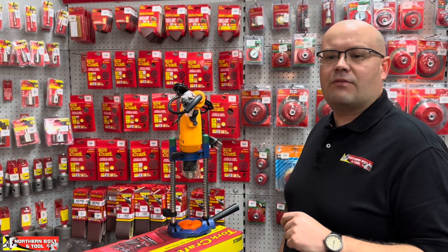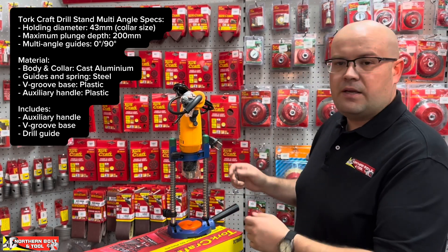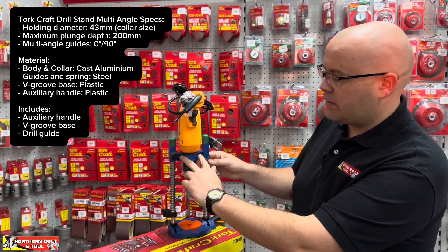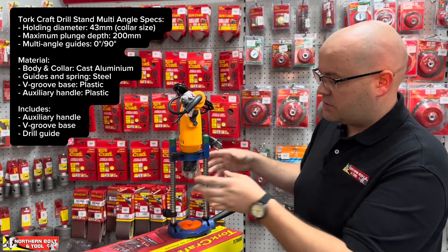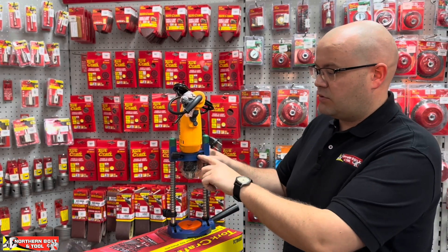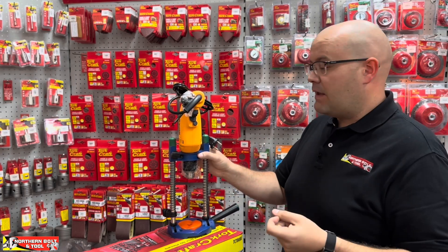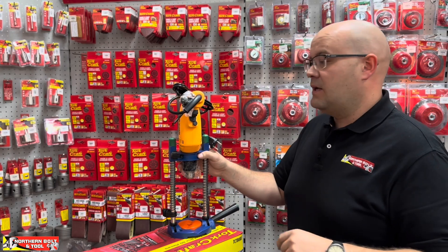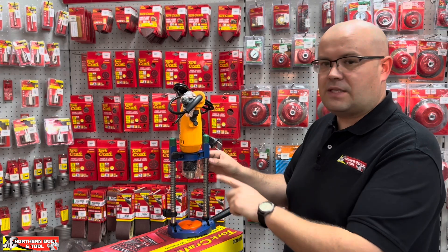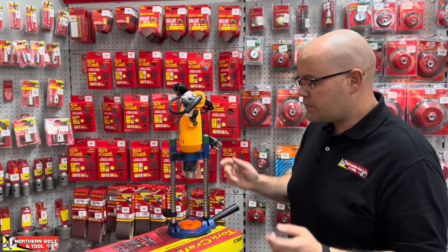Alright, you've seen the drill stand — now it's time for the Multi-Angle Drill Guide. This is how the setup looks when you've got it set up. This one's a little bit more fiddly when installing the drill. There are two little cap screws over here that you need to fasten, which fastens the drill in with the collar. Same story as the drill stand: you need to ensure that your drill has a proper collar for it to grip on. If you do need to look at additional drills, we've got plenty available that are suitable, and we'll link a few options in the description below.